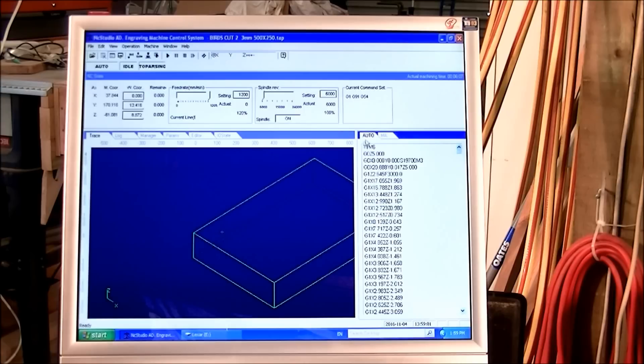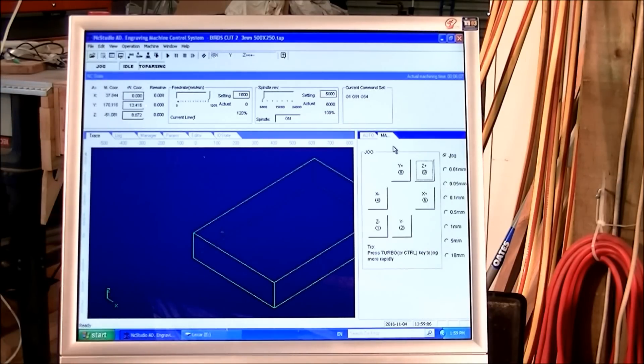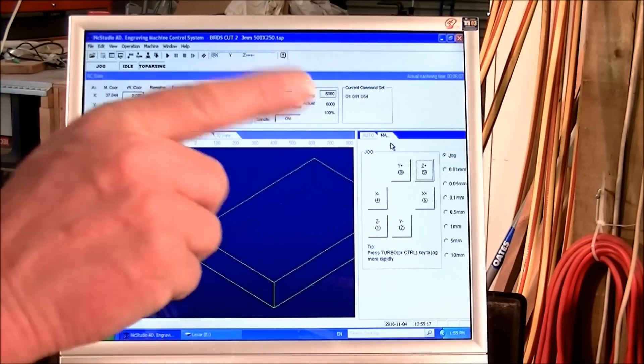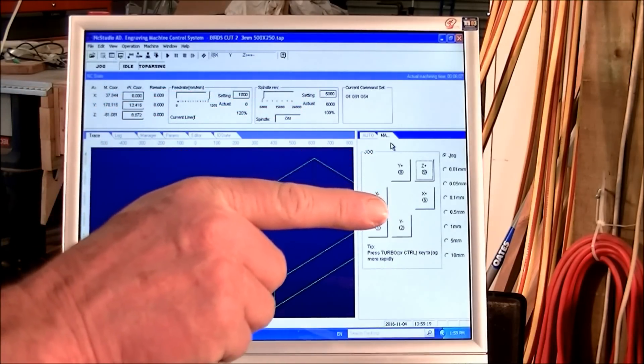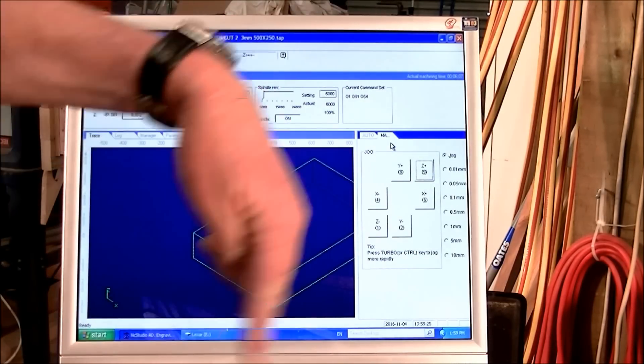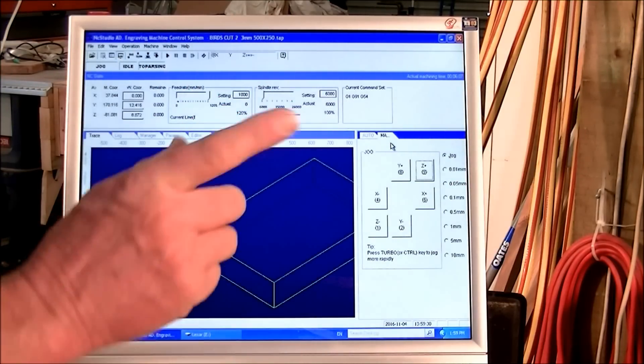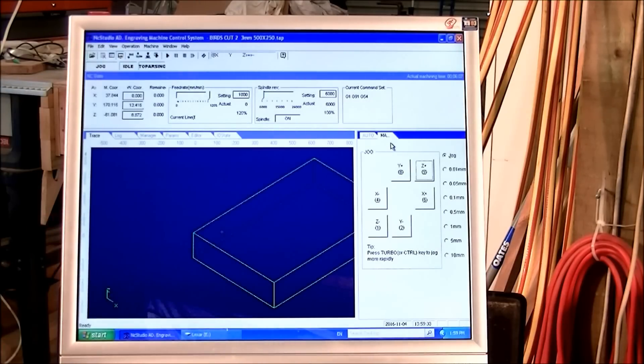Here's the G-code window. To get out of that I just press on the next tab, it'll take you to the job window, and I'll just change the tool. I'll show you what I mean about the 3mm — what you saw the 6mm do was, when it comes to a deep point it just digs straight in. If you're not on the feed rate and you slow it right up, you'll snap a tool off for definite with the little 3mm. So you'll see that in a minute. I'll just change the tool and show you that next.